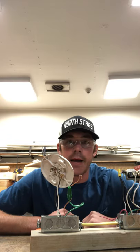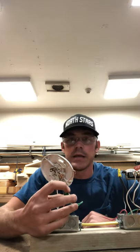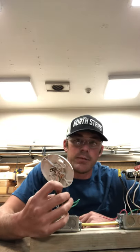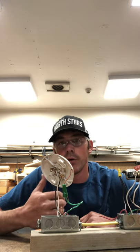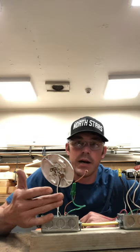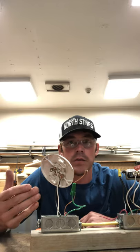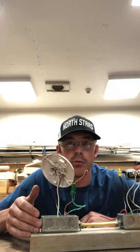In any household, if you're going to make any kind of updates or changes to the electrical in a room, you could always make that change easily. Any appliance could be changing — this lamp holder currently doesn't require a ground, but in the future I could have a different lamp holder or even a fan that requires a ground. I could easily have that ground installed because I already have the ground there. All I would have to do is take a little wire and hook it directly up to the appliance that requires that ground.